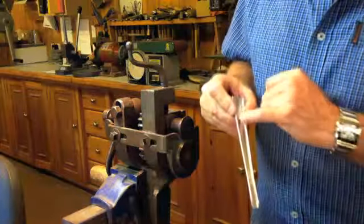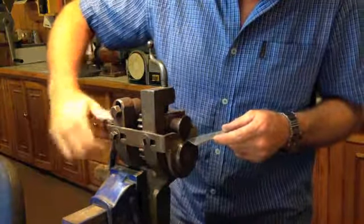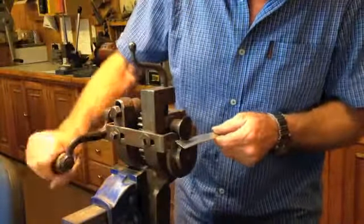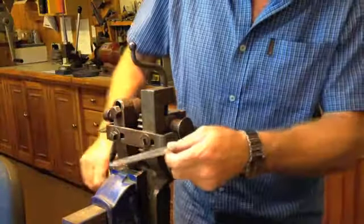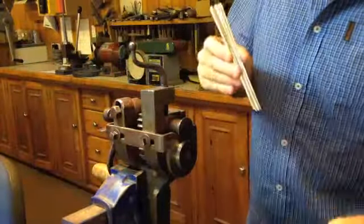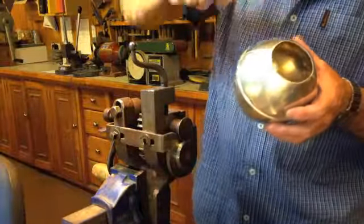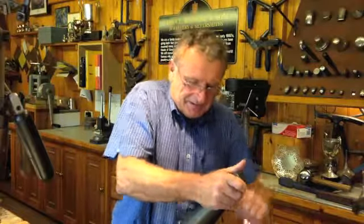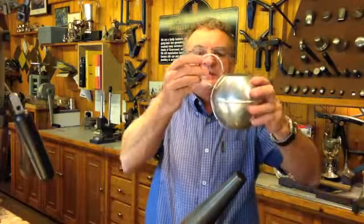Now we've got the two silver wires put down the edge here. It's going to be put through the Jenny again, adjusting the guides, and this will then raise the two edges up as I require them. That's one side there — do the same with this one. That's the section that will match here, and then that will be bent around now to form the handle. This is just a steel stake that I'll bend it around. Here we are, you can see it coming on now.